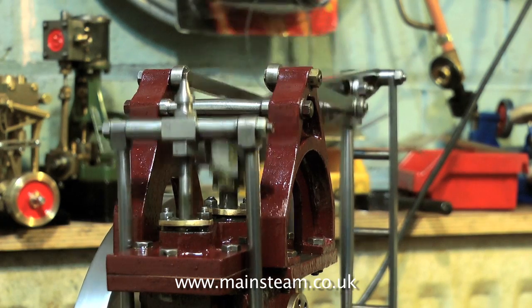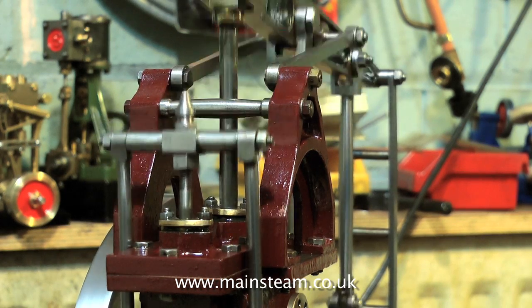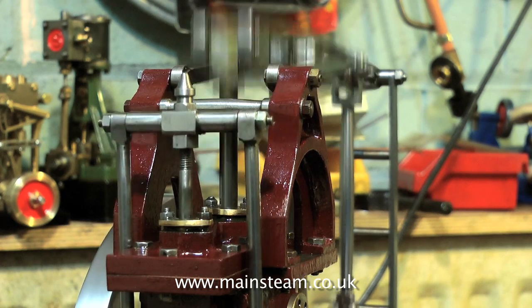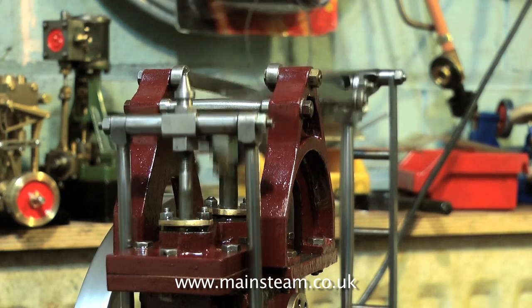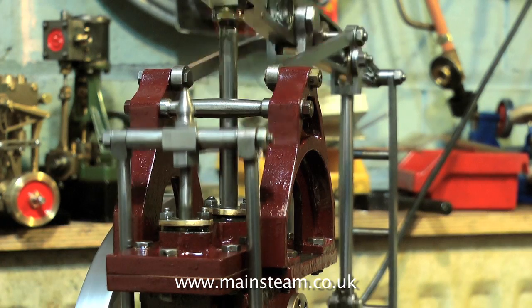The valve's better though. I machined the valve so that the travel is much improved, and I also made an ornamental valve nut for the top of the spindle. Originally the valve was not right at all — both of the nuts had to be slack to allow it to move up and down without fouling. But I machined a small amount off the valve carrier, and now it travels up and down the valve chest as it's supposed to.